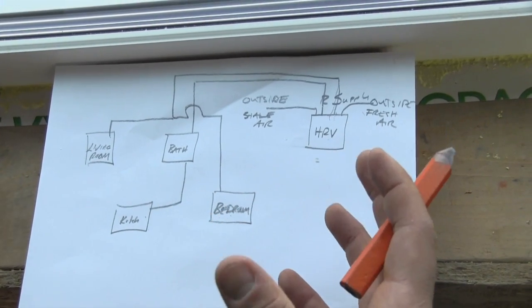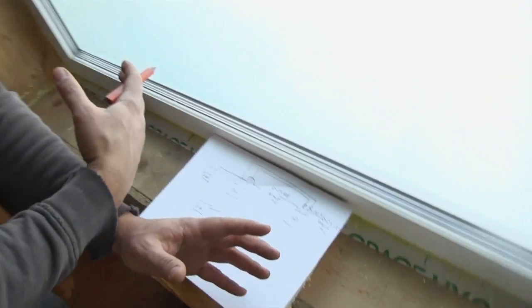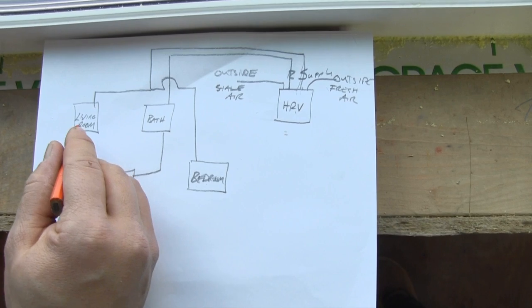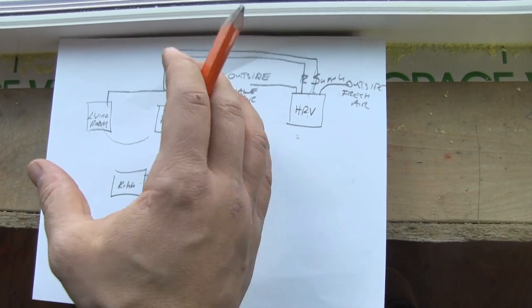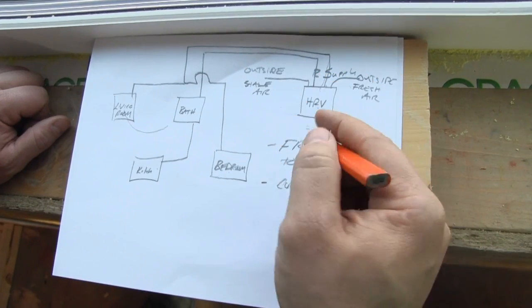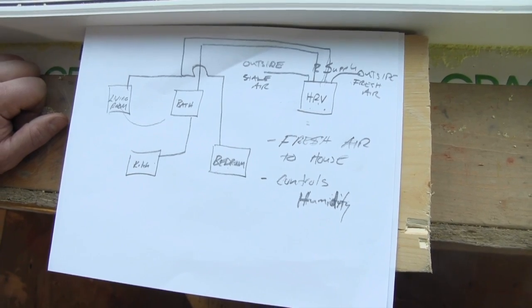You get cold air outside, hot air inside, and it makes warm air while also exchanging for fresh air — basically removing stale, moist air out of the house without blasting cold air in. It pushes air through your house so air coming into your living room will return and go to the bath and get sucked out. You have this constant circulation of fresh air running throughout your house. That's what an HRV does — heat recovery ventilation — it controls fresh air and humidity in the house.